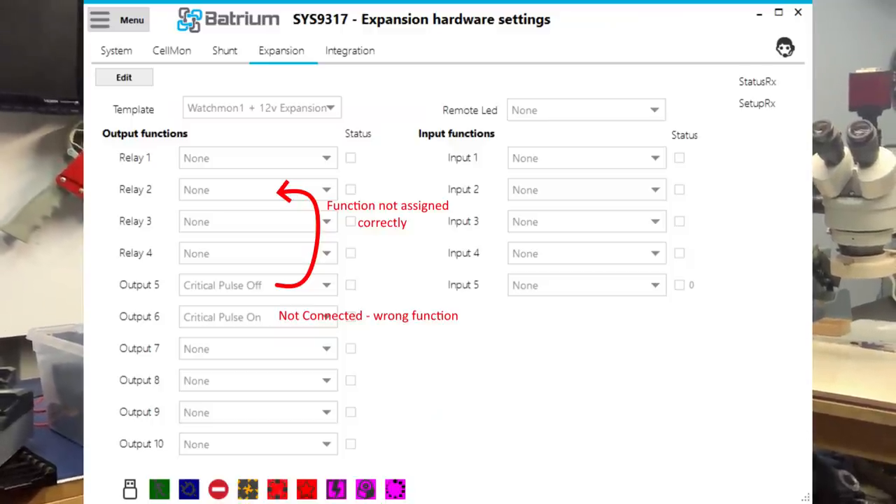From the editing desk, a couple of hours later — I'm going to insert this first so people can ask this question. I decided to hook the Batrium up and have a look. What I found was Relay 2 was connected on the Batrium but it was set up for Output 5 and Output 6. Output 5 should have been on Relay 2 and Output 6 shouldn't have been there. I also found a problem with the Batrium software where the inverter wasn't working via CAN bus because of incorrect settings. That could have happened years ago, I don't know. But that definitely didn't contribute to those cells catching fire.